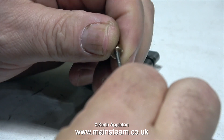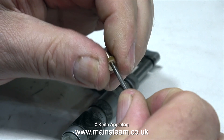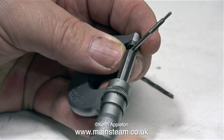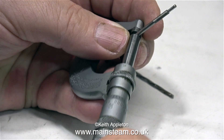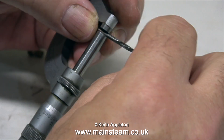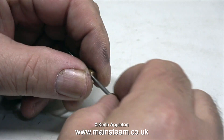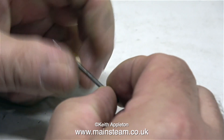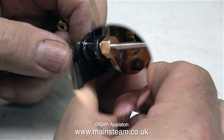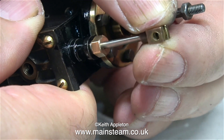Because of the turning operation, one end of the hole has a burr over it, so I'm using the reamer to clear this. In this clip I'm doing a test fit of the valve rod into the new gland nut and it's very tight — in fact it doesn't fit. So I'll check that the valve rod is actually 3/32 of an inch. Rather than using a digital caliper I'm using my very old Moore and Wright micrometer and comparing the size of the shaft to the shaft of the reamer, which one presumes is exactly 3/32 of an inch. The solution is surprisingly simple: this is a piece of stainless steel, and when I threaded it the threaded part got slightly distorted and the die raised a burr on it. A quick touch on the polishing spindle with a bit of abrasive compound took care of that, and now it fits perfectly.